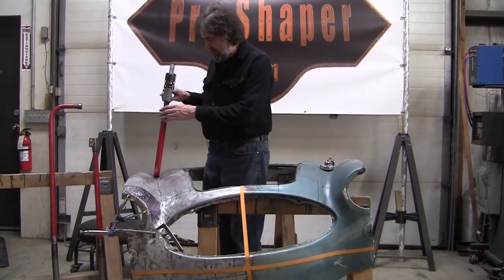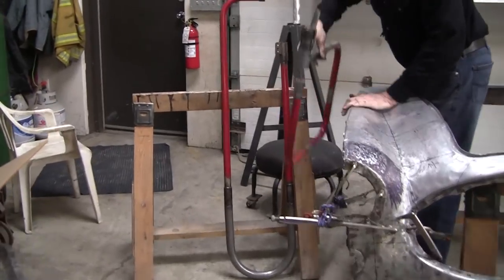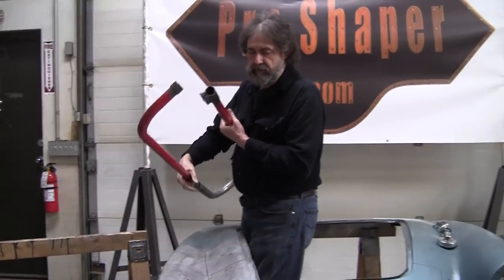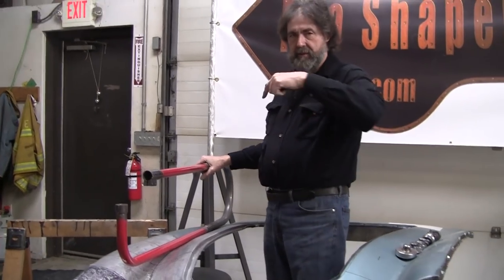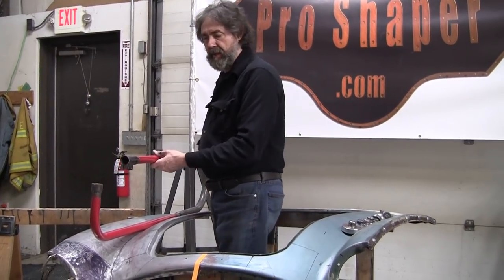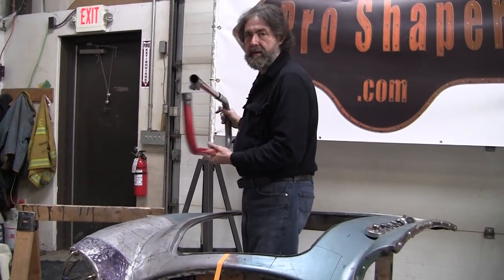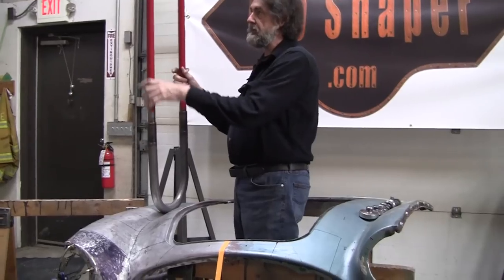Now this is another frame here, and this is a frame you use on the air planishing hammer — and this is where this shines as opposed to a mobile English wheel. This one we use if you have a situation — and a lot of people put inserts in roofs and stuff and they weld them in and you have to hammer out the shrinkage from the weld. So you need a deep throat like this, and you can go along that weld and hammer that weld out really nicely on the whole entire roof. So this is a very, very useful tool.